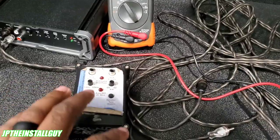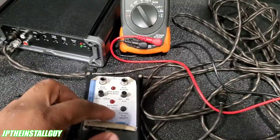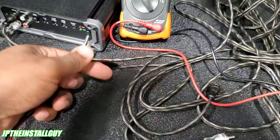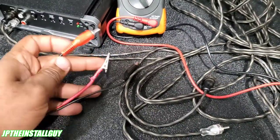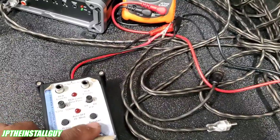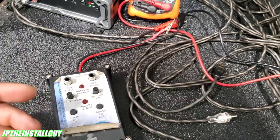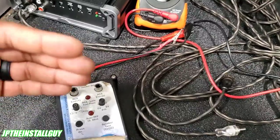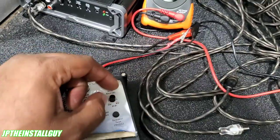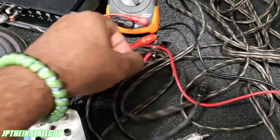The first thing I would do is grab a phase tester — I have these linked in the description. Basically, it has prongs on the top with alligator clips for positive and negative, and it also has an RCA jack. Inside is a 9-volt battery. You can do a speaker test or press and hold the button to turn it on for five minutes, which gives a constant pulse. You can adjust the hertz and the volume.